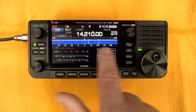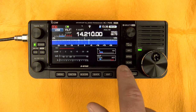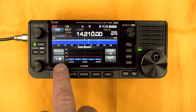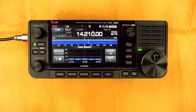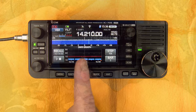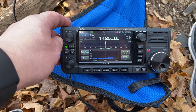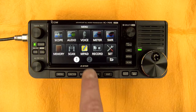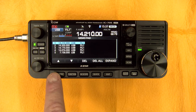Here you have the meter view — you can still have the waterfall alongside all the meters in one view, which is great for doing tests. You have the possibility to scan the frequency in a wide span and check your SWR. When you're out in the field tuning an antenna, you can center your tuning and move up or down 20 kHz. This feature will show you where you are at center, but you need to key the PTT each time to complete the scanning. Then you have your memory that you can edit, your scan, your memory pad — the five-slot quick memory — which you can recall there.